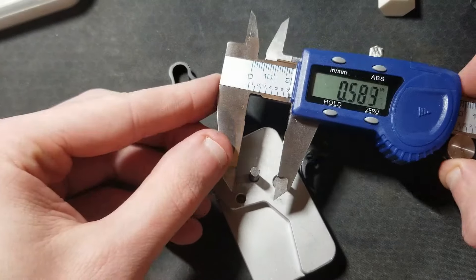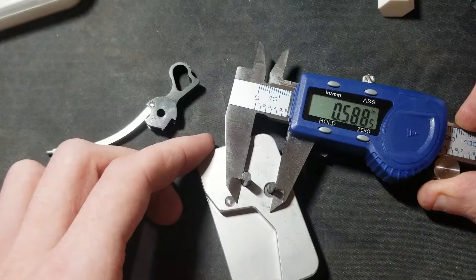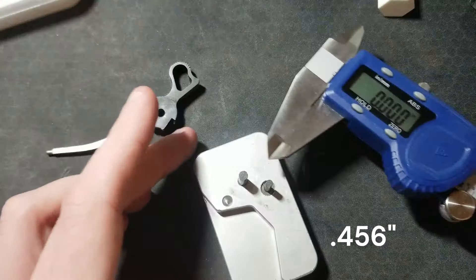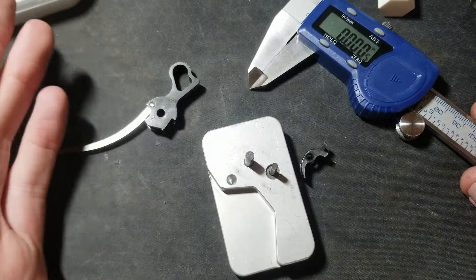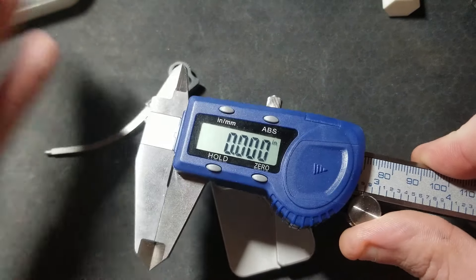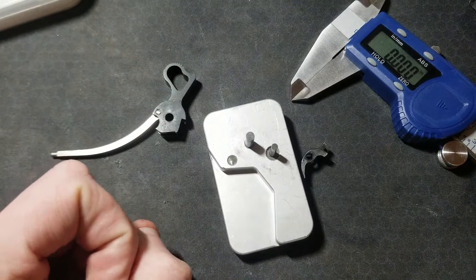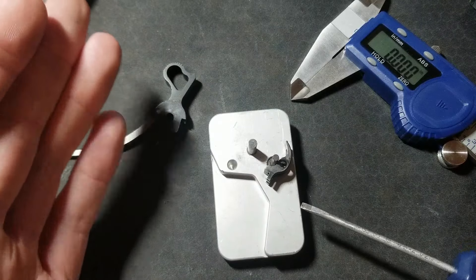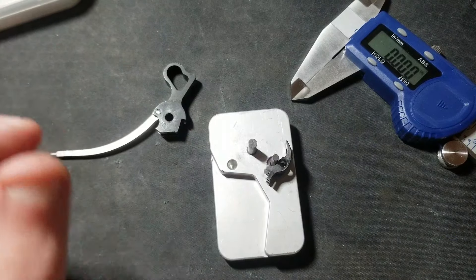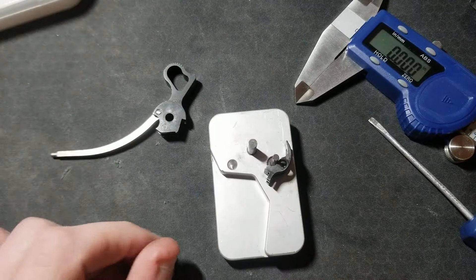This is very easy to measure now that the two pins are actually tight. With my calipers, then subtracting half the diameter of each pin, I got a measurement of 456 thousandths. That is about one and a half thou off the desired dimension, and these calipers have an accuracy of plus or minus half a thousandth — so I'm somewhere between one and two thousandths off the correct dimension. I'm pretty pleased with that. I also measured parallelism of the pins along the 300 thousandths width of my sear and hammer. I could not measure any deviation, so that means I'm just within the plus or minus half thou accuracy of my calipers.